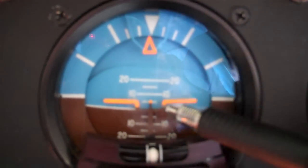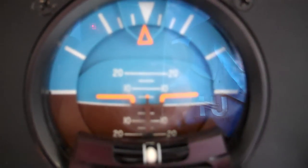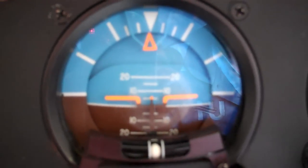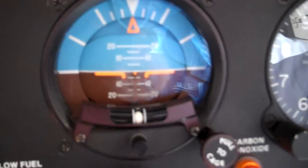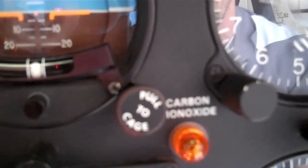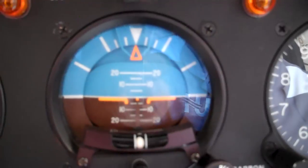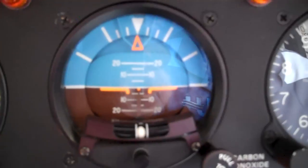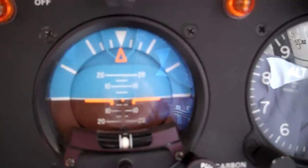On the pitch, if you look right here, you have 5, 10, 15, 20 degrees of pitch, and it's the same in the other direction. With an Attitude Indicator, the first thing you've got to do is make sure that the gyro is erect. One thing I can do is cage it and make sure that it's straight. A gyro is a spinning object that tends to stay in place unless an outside force acts on it, and that's nice because we want it to stay put as the helicopter and the instrument move about the spinning gyro.